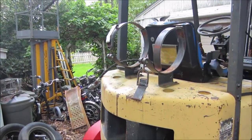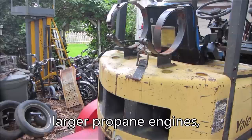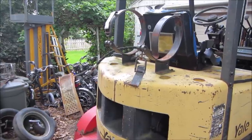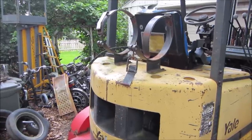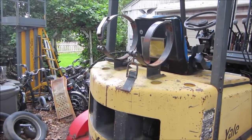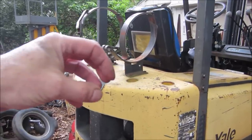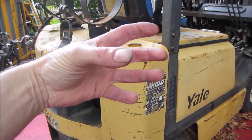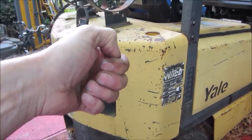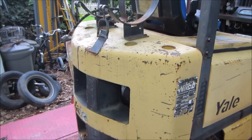I was thinking you could run it on a gas grill propane tank, but forklifts and gas-powered engines of any sort run on liquid propane. The liquid goes down to a vaporizer, then the vaporizer goes into the regulator, and the regulator is tied into the cooling system to keep it from freezing. If you try using just vaporized propane, the volume you're using is so much that it would freeze. So to combat that, it goes down the hose as liquid, turns to gas at the vaporizer, and the regulator cuts down the pressure. Running it through an orifice creates cold, so inside that regulator there's a line going in and a line going out to keep it heated.